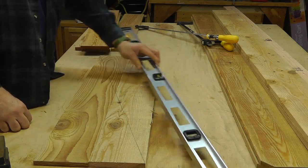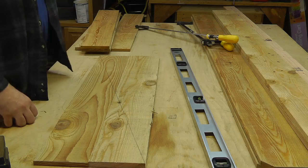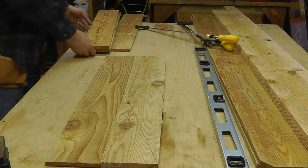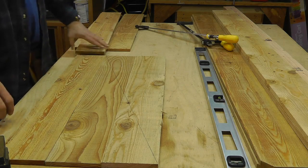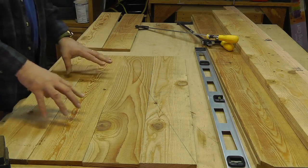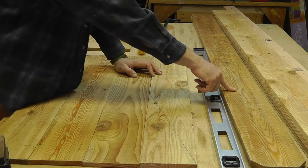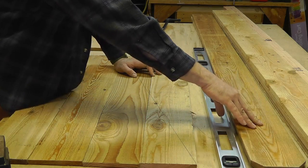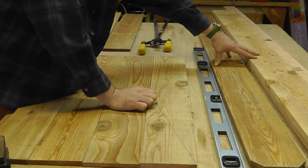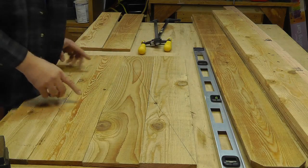Here are the top two pieces. I took my straight edge and went from corner to corner and I'm going to cut diagonally right across here. I've decided to not glue these yet because they're just too wet. I'll put the boards down, put the braces on, then cut the remaining seven boards at four foot for the front and back. The leftover pieces I'll rip on the table saw and use as braces to hold the side pieces together.